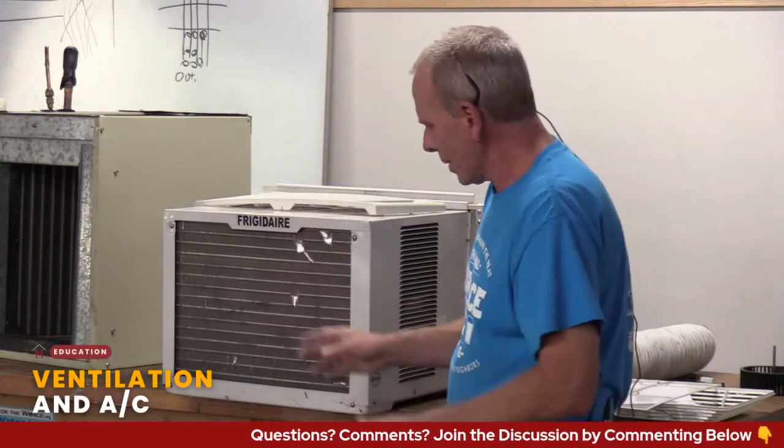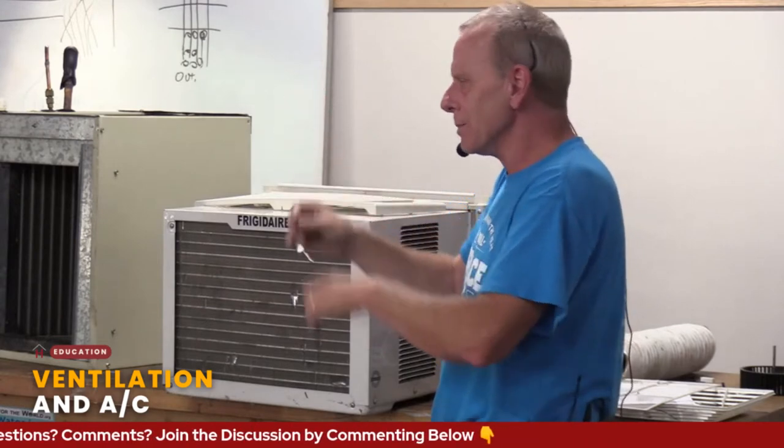So all of them are a little different. But if you have one of these, take a look at it. Because what happens is stuff gets in there, and I've seen it where those little drain ports get clogged up with just gunk. And that water goes somewhere. It usually goes into your house. So it should be tilted to the outside just a little bit. And it'll drain out, and then your drain or your weep holes should be cleared out. That's kind of that yearly maintenance thing.